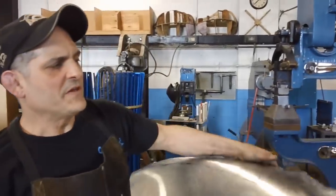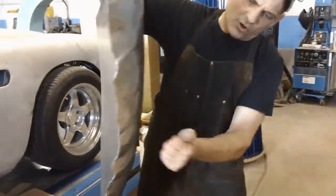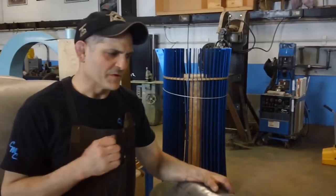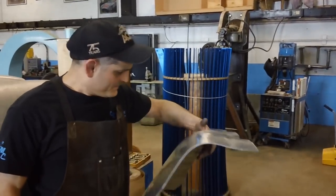You can kind of feel the part will start ringing a little bit, but as you're shrinking, you'll feel it start getting stiff on you, and it'll feel like it wants to spread out as you're shrinking.